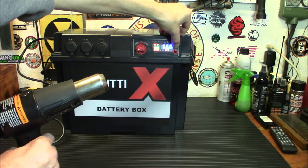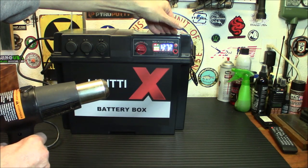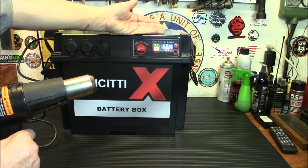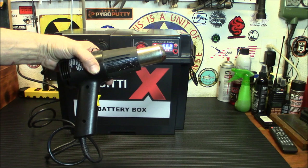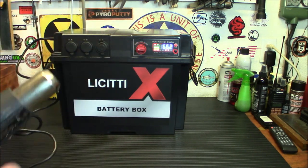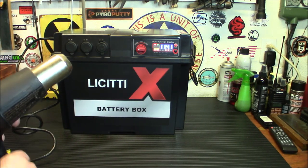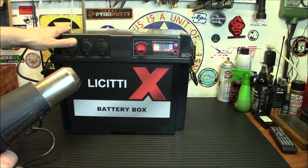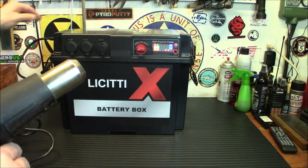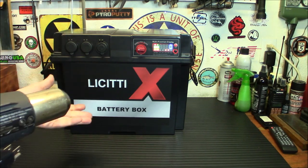Battery is showing 12.4 volts. AC voltage is there, and watts coming out are reading 666, 664, 662 — those are your watts. It definitely will handle a high-drain device. I could hear the fans going while this was running, so it's good to know the automatic fans kick on once you reach a certain draw level.